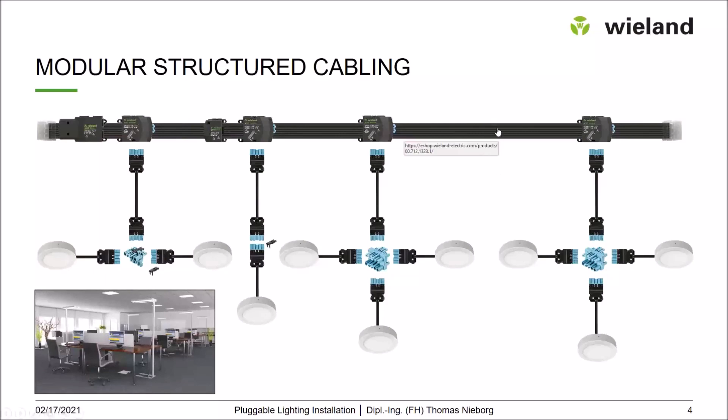In that case, you have a five-pole mains supply — neutral, earth, and three phases — plus a two-pole signal section, making an overall seven-pole flat cable. Again, five-pole outputs are available, and you can choose the supplying phase to connect to the luminaires. These flat cable solutions make the whole system very, very flexible.